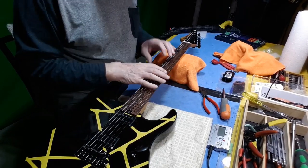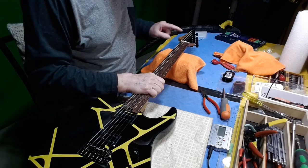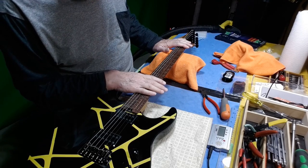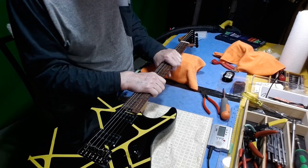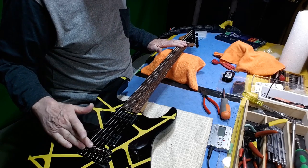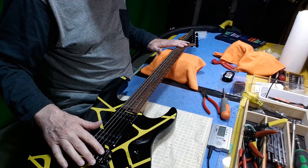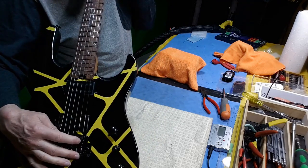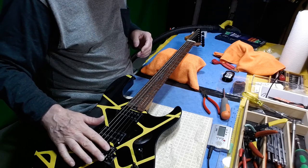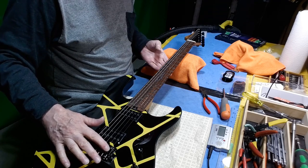It is time for dismemberment because I've adjusted the nut slots. I haven't taken any meat off the top yet — I'll do that when the neck is free. I've pre-adjusted the truss a little bit. I readjusted a couple of the strings here for action. I find that the B string is still a little bit high. I might have to change the length of the set screws in that; they're very sharp on the top. All the rest of them I've gotten close enough that I don't think they'll worry, except for the B string.